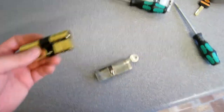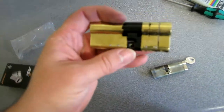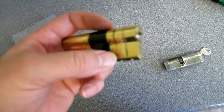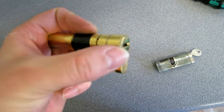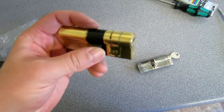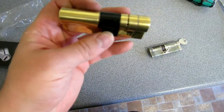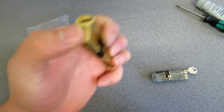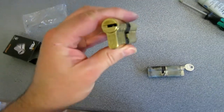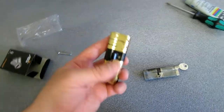There are new types of locks. I've never used this brand before — this is ABS — but apparently these are really good. I did lots of research and this seems to be the right one. If you look here, this is the external section marked 'ext' and it has a sacrificial line, so if it's snapped off it remains locked. The thing to look out for is this Kitemark and the three stars — that's a TS007 triple star rating. The other rating is Sold Secure, and this lock has both, so it should be very good.